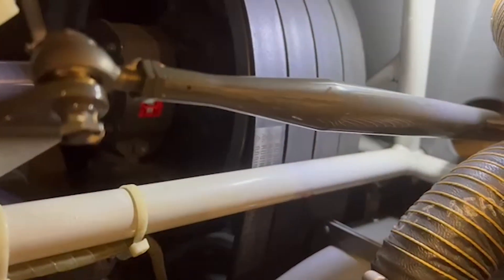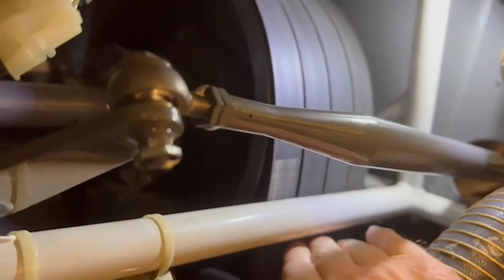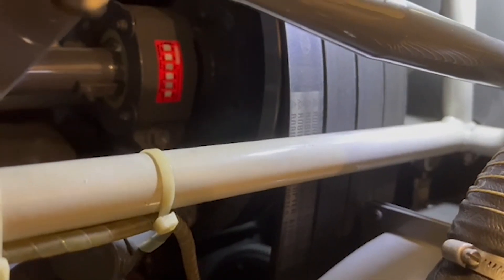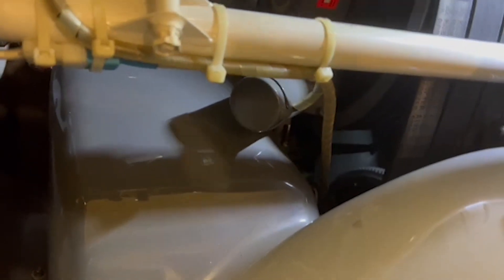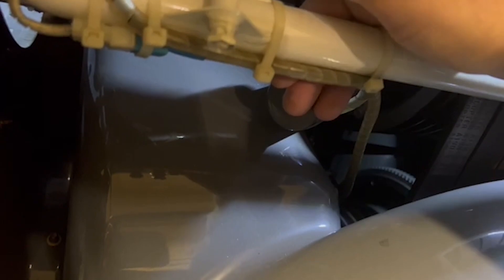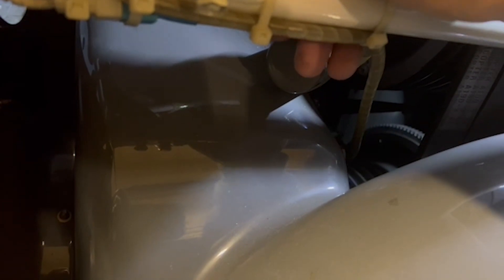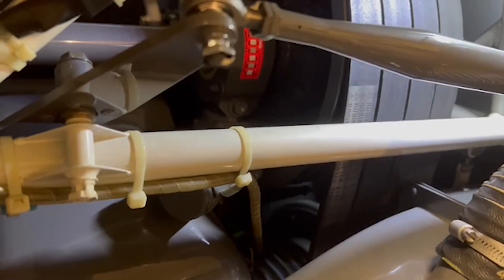Now, why this is not an issue with the R-44: if you look, the frame that runs by the sheave is actually parallel to the sheave and doesn't angle in like on the R-22. The drive motor is here with ample room - there's ample clearance between the frame and the back of the motor that runs the clutch assembly and tightens the belt. That's the reason those two items don't have to be on the R-44 checklist.